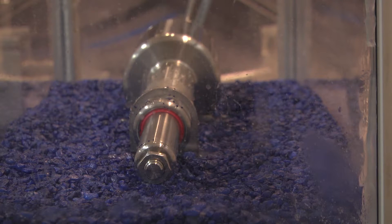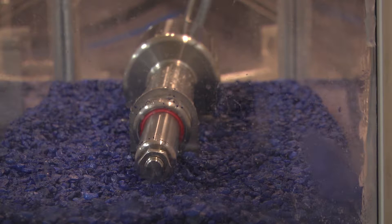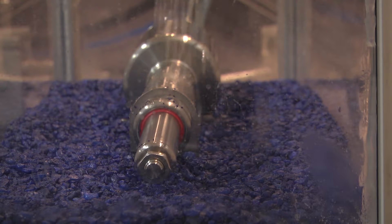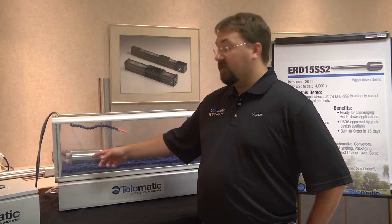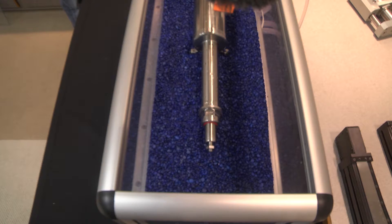The unique feature of the ERD stainless steel is it's made for wash down environments. We have an IP69K seal on the front keeping water and ingress protection out of it. We have a stainless steel can covering the motor keeping water out from touching the electrical in the motor. That's what's unique about the ERD — it's intended for the food and beverage market.